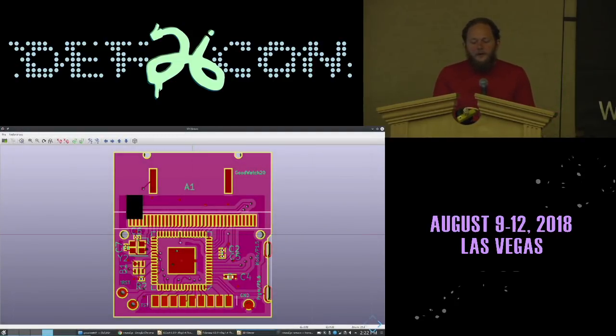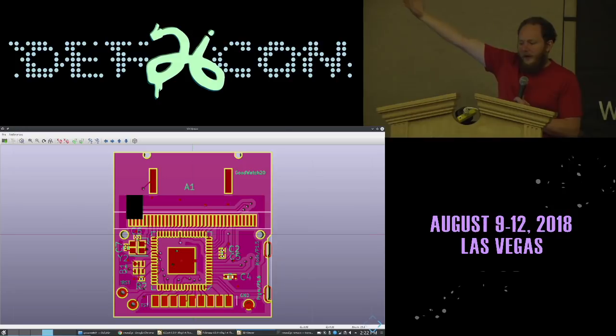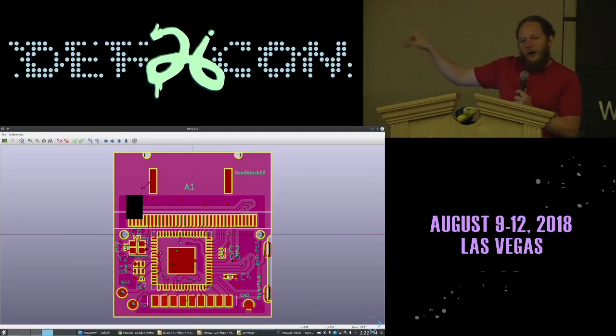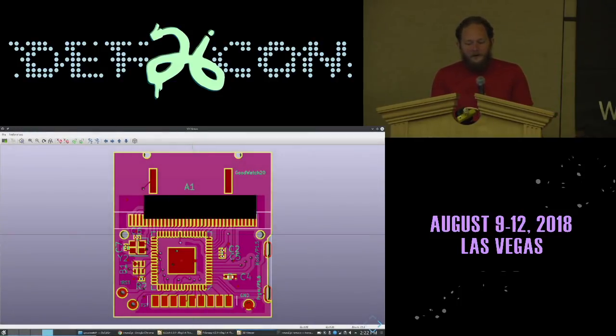But having the board is only part of it. You also need to know which pins do what. So the black bar here that is blocking some of the pins on the far west of the LCD, those pins are called commons. And a common is connected to very many segment pins. You can think of this as like a row and column for a driver. And you have very few rows and very many columns. And then they're wired up to fit the individual pixels of the LCD display. So these are the commons, and these are the segments.